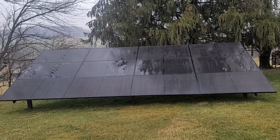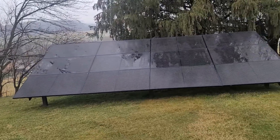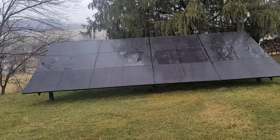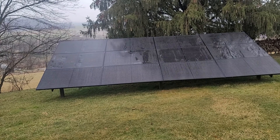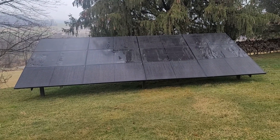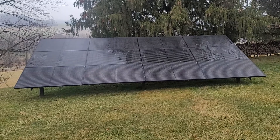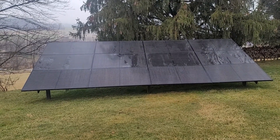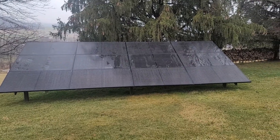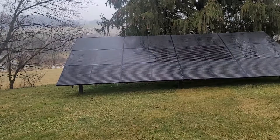This is actually only the second time I've had to fire that generator up, and that's only because we're running the whole house off 600 amp hours worth of batteries. With kids in the house, everyone's watching TVs in the rooms, lights on, refrigerators, freezers — everything is running in the house. So to be on 600 amp hours of batteries, can't complain.